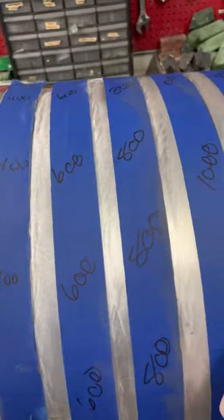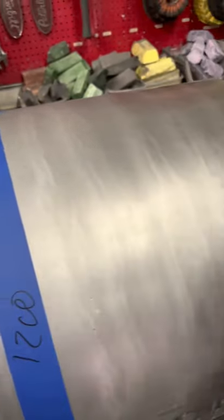Completed with the 1,200, we're gonna swap to the 1,500. Four hundred, six hundred, 1,000, 1,200 - it's done all the way across. It's getting really smooth but it's not really bringing out any more shine. You can see the pores are really closing up and it's getting really tight. As soon as those pores close up it's really hard to get the buff in there. Like I said in a previous video, our brown compound cuts at technically 380 - I do 600 just because it goes faster.